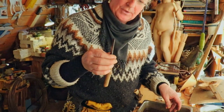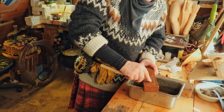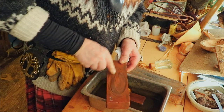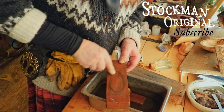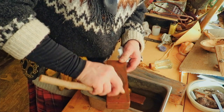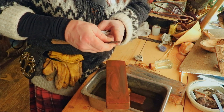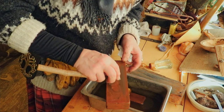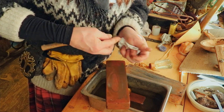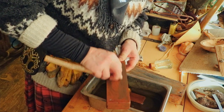Back to the chisel — I'm going to do most of the work on the beveled side. The earlier part of what I was doing, I was working back into the heel of the grind, which is good for maintaining your angle. I tried to use the whole stone too, so it doesn't get too dished in one spot. It's always just this one corner.